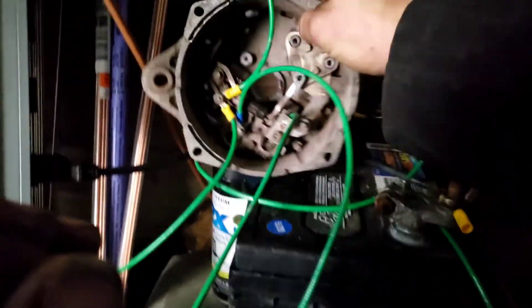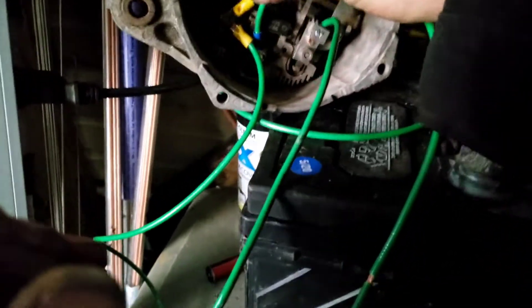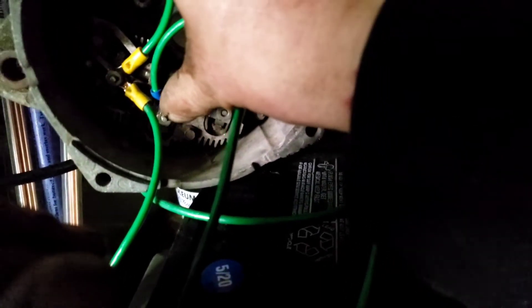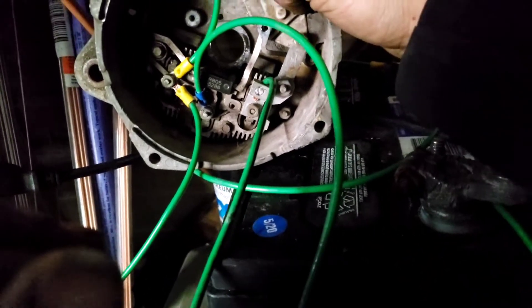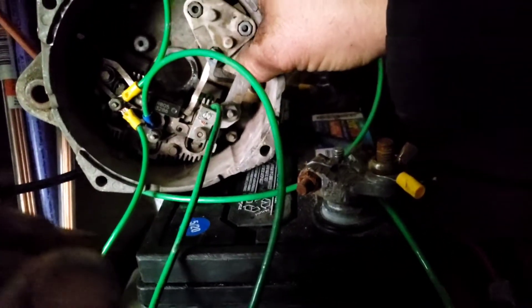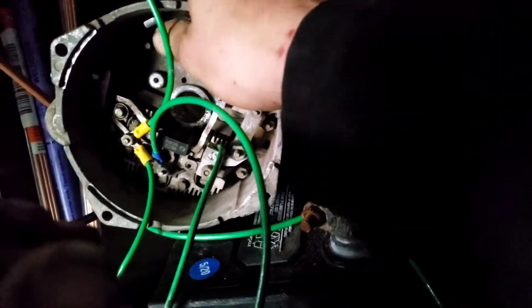The alternator has three wires that come off of the windings. Originally one goes here where that little bolt is, one goes here, and one goes here. That's where it takes the AC out, and then it gives you a 14 to 15 volt output, with the positive being right here and the negative being the frame.